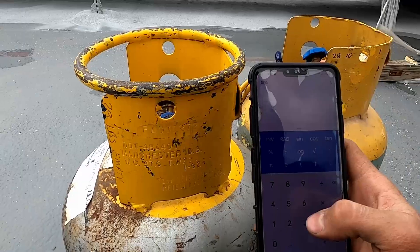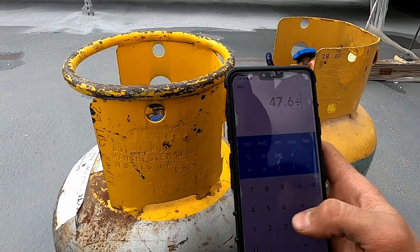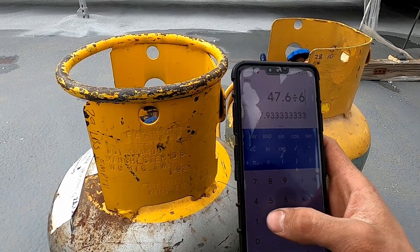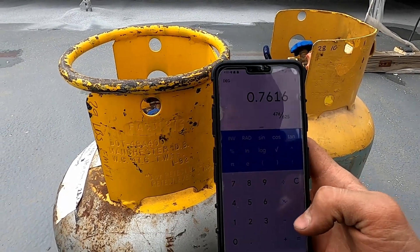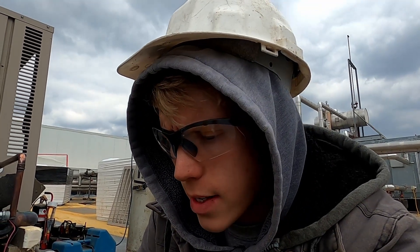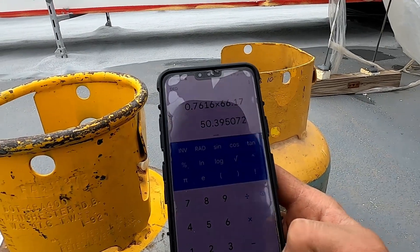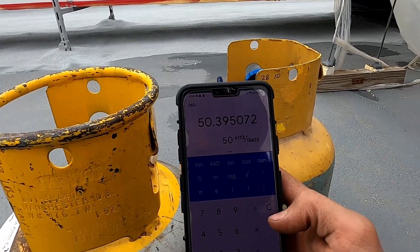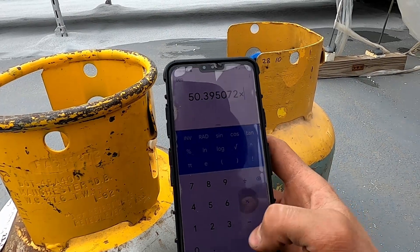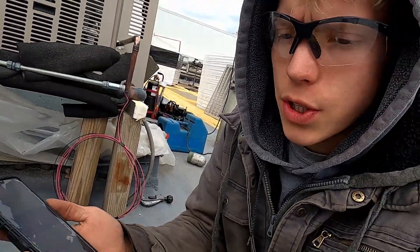Let's run through those numbers again. Take our 47.6, which is our water capacity, divided by the density of water, 62.5, equals 0.76. Then take that number times our liquid saturation density of R22 at 130 degrees, which is 66.17, equals 50.39. But we're only allowed to fill 80%, so we multiply that times 0.80. That is how we figure out how much refrigerant we can put in the cylinder.